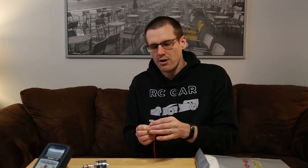Now connect it up so we can power and energize our circuit, take our readings, and then use a calculator to figure out the internal resistance. Before powering this up, we only want to power the circuit for a small period of time — about four seconds. The reason is that heating the windings changes the internal resistance of the wire. We want to power it up for the smallest amount of time possible to keep it as cool as possible.